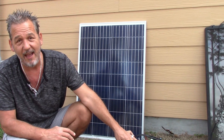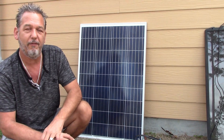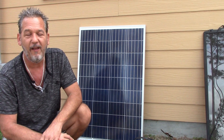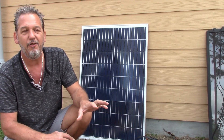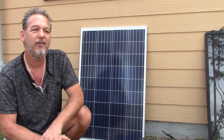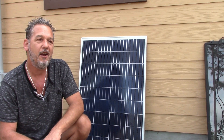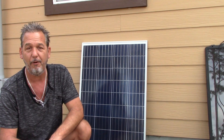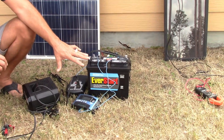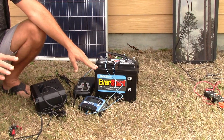I'm wiring my five batteries in what's called parallel, which means they remain at 12 volts. I could wire them in series for 24 volts, 36 volts, or 48 volts, but in my case I don't need to do that. I built a super high-efficiency home here — my air conditioner by itself takes less power than three 300-watt light bulbs. So I don't need a lot; I'm good with 12 volts. I have five batteries and eight panels, and that is more than enough power.